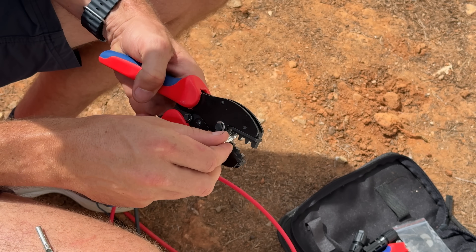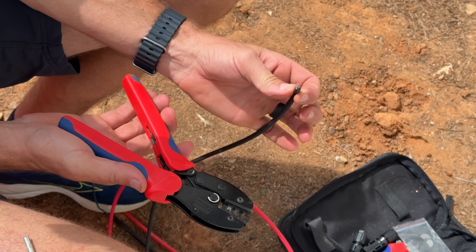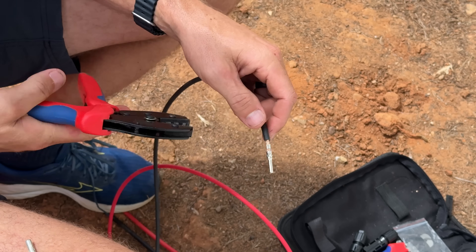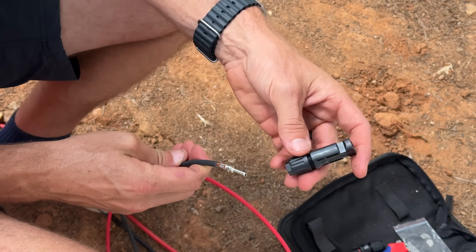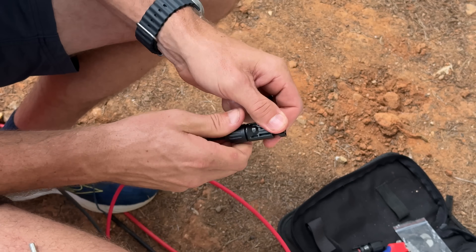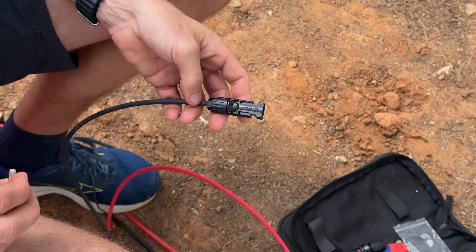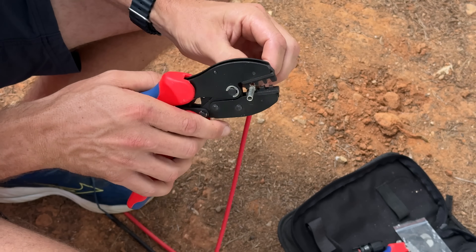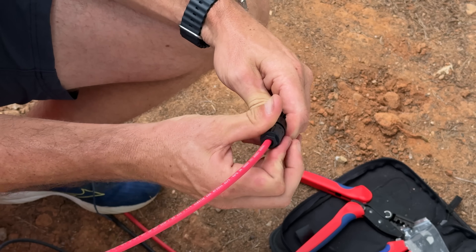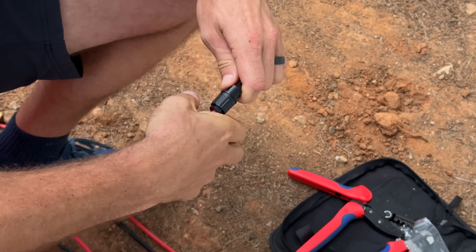Now finishing off my cables — if you haven't seen standard MC4 connectors before, this is 10-gauge PV wire with thicker insulation than typical residential wiring. There are male and female pins, so you need to pay attention to which you're crimping on to get the right gender. This is what makes it MC4, and it lets you mix and match across brands since they all use this standard connector. You insert them in, there's an O-ring to seal it, and then you hand-tighten the gland connectors on the end, which press a seal against the wire insulation for a weather-tight seal on both ends.